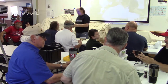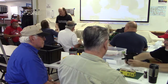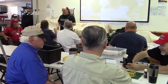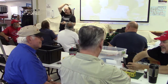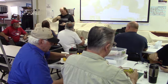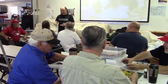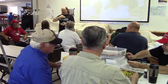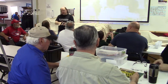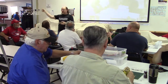Now, when you're painting or staining, are you wearing your brush down? Yes. That means it's filling up on the tabs. Well, not only that, but stop and think about it from a weathering perspective. Rain's going to hit, and it runs straight down. So any brush strokes that you get, either with the stain or with the paint, are vertical, and it will look more natural. If you paint them the other way, even if you had it all glued down flat, everything nice and tight, you'd get brush marks across here, and your brain's looking at it.